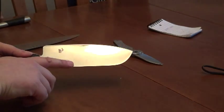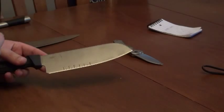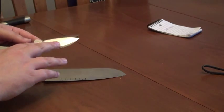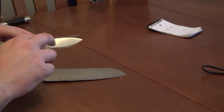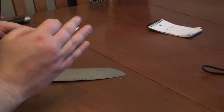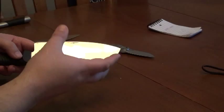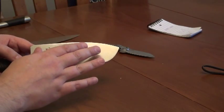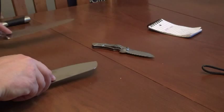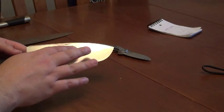This is a Santoku from Spyderco made out of MBS-26, which is very similar to 19C27. 19C27 is the steel made by Sandvik that's a slight variant of 13C26. So when you like the behavior of 13C26 in regards to hardness and ease of sharpening, but you'd like the ability to stay sharper at a lower level of sharpness a little longer and you're not that concerned about corrosion resistance, 19C27 is meant to be an upgrade. The primary carbides are a little bigger, and you'll find it doesn't take that really high level of sharpness as easily as, say, 420J2, or a properly hardened 13C26, or 1084/52100 — all properly hardened. It's still relatively easy.